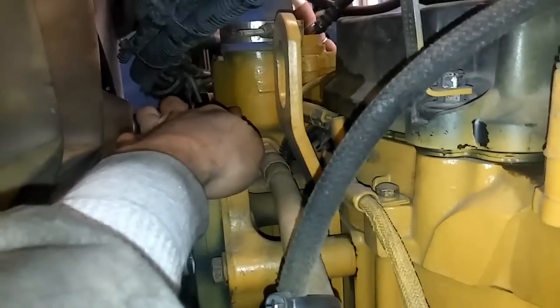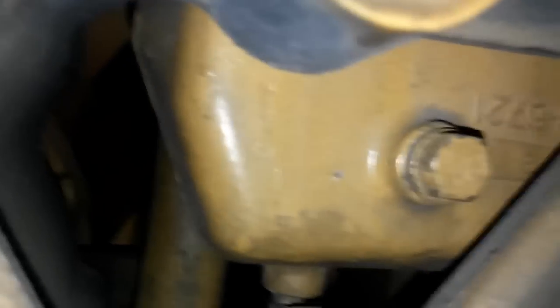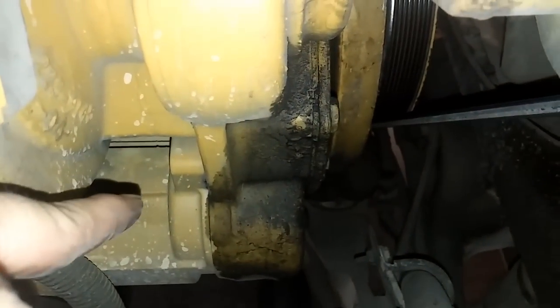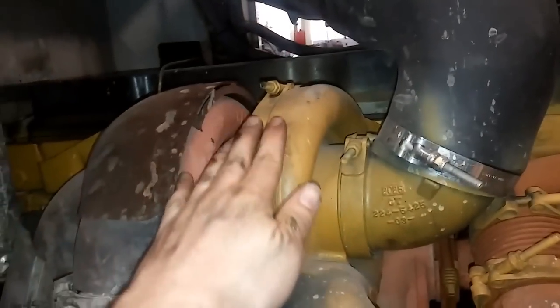This is your front cover. This is a pushrod engine, so the cam cover does not go over the head. And your thermostat housing. Now we're on the exhaust side. This is your thermostat housing - on the bottom is your coolant temp sensor, facing up right there. Your thermostat housing has a single thermostat. Unlike all other CAT engines, the C13 only has a single thermostat. We have your pre-cooler, which is coolant cooled for your boosted air, and your coolant diverter valve for the pre-cooler. Gear-driven water pump, and your oil pump, which is under the water pump, also gear-driven.